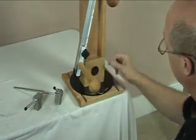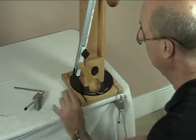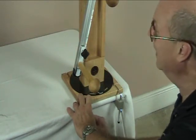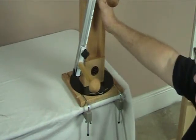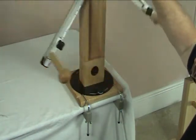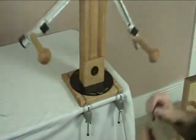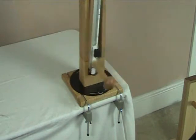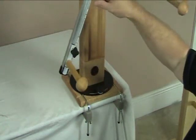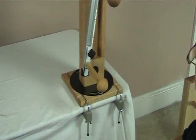Normally you'd have the knobs at the front and back, and the two clamps installed. That way, if the yarn pulls during winding, the unit can't get pulled over. When the clamps are installed, the unit is extremely safe. Remember, you're dealing with extremely large aluminum arms that won't give way if they hit something. Be especially careful with small children in the area, as this can be extremely dangerous if misused or treated as a toy.